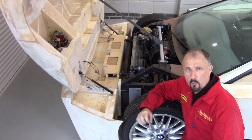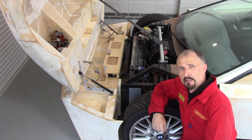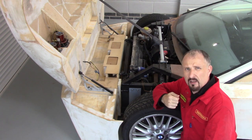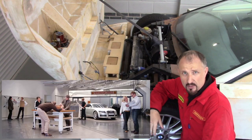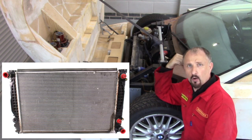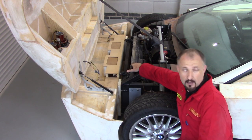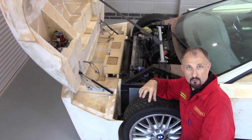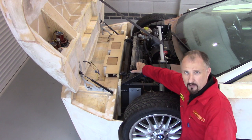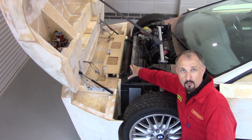How do we make a few shortcuts when we're building our own DIY supercar or kit car? Well, one method is to use the cooling system from the donor car where the engine came from. Some Audi engineer — or probably a team of engineers — had already worked out the volume of the radiator, the operating temperature of the engine, the temperature and pressure that the coolant will operate at, and therefore the pressure on the safety release cap on the expansion tank. All this has already been worked out. So if you take everything from the donor car and install it into your car, good chances are your cooling system will work.